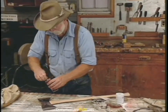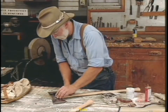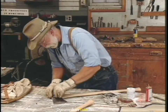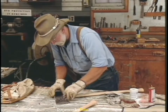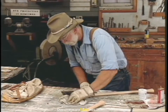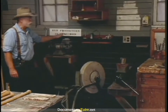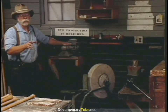One last thing you need to do is protect the axe head. What I like to do is put a little lubricating oil and some beeswax — the oil cuts the beeswax — and rub it in. It gives it a real good sticky coating that stays on it. Wipe the excess off, and it comes right off when you go to chop, but it keeps it from rusting. One last thought on sharpening: this is a high-speed grinder. Do not use these on your axes — it will draw the temper out of the axe, burns the edge, and ruins a good axe. Use a file, then use your axe stones.